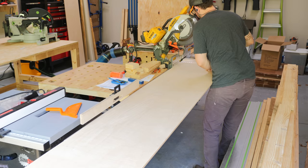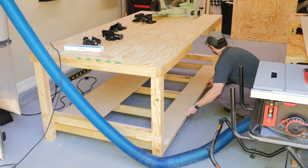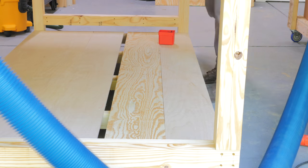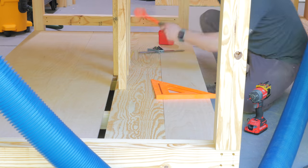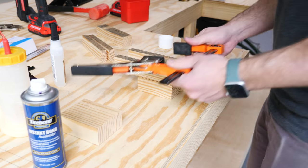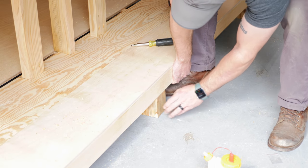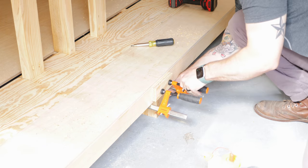Next I could work on adding the sheeting on the bottom shelf, and I used some random bits of half-inch plywood for this — these pieces were actually left over from my home theater build I did a few months ago. After adding that plywood, I also added some vertical supports that will help to keep the center of the top from sagging over time, and these will also function as stops for the drop-down miter saw platform. I also went ahead and added the center legs to the base at this point. Rather than trying to actually notch out the legs, I just glued up separate pieces to create my joinery here, so that the notch section could straddle the center piece of the bottom framing to provide more support and plenty of glue surface.